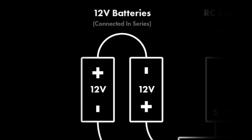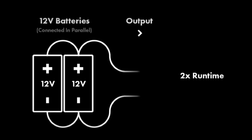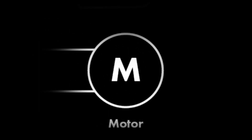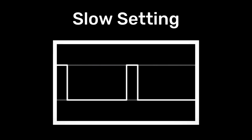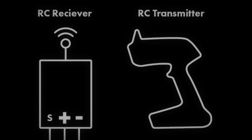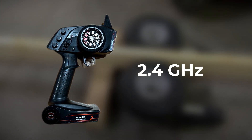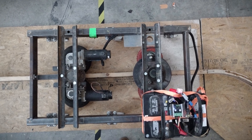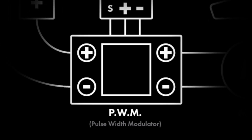The electrical component consists of two 12-volt automotive batteries connected together in series that get sent to a pulse width modulator circuit board to have more control over the speed, and this is controlled remotely from a remote control receiver to allow for the drivers to be on the outside of the cart when driving. The batteries are wired in series to combine the voltage amount. Alternatively, they could be connected in parallel, which would keep the output at 12 volts but double their runtime. With the salvaged motor, the speed is controlled by the voltage being sent to it. The pulse width modulator acts as an automation clip for the voltage being sent to the motor — it is still binary, but by using variable spacing between each pulse, it can control the speed to go faster or slower. This also helps retain the torque by having the motor receive the full 24 volts sent by the pulse width modulator, but only in the pulses that it sends out. The chassis uses a remote control transmitter and receiver operating at 2.4 GHz radio frequencies. A trigger on the remote sends an output to the receiver connected to the pulse width modulator, which changes the variable spacing and therefore controls the speed of the motor.